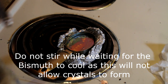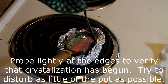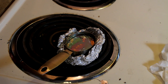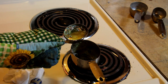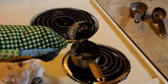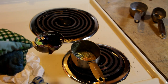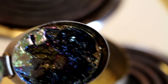Okay, it's been about four minutes. Definitely have some hard material here, and I am definitely getting some solids. So we're just about ready to pour. Take this, and the key is to pour very, very slowly as many of the crystals are stuck on the top — you don't want to pour out your nice crystals. And there you have it: nicely formed bismuth crystals.